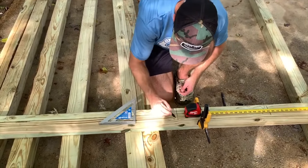Again, we're gonna have our overlap edge positioned so that it is flush with the outside of the wall there. Then I'm using the temporary screws again, stupidly. You can see we're gonna have a butt edge there. Don't worry about that because we're gonna cover it with trim in a later video. So here you can see that that first panel is lining up directly in the center of a stud so that when we install the overlap edge of the next sheet, it's gonna be directly in the center of a stud.